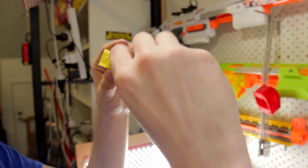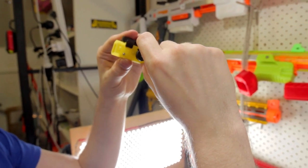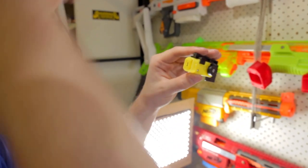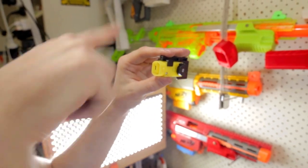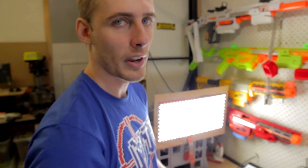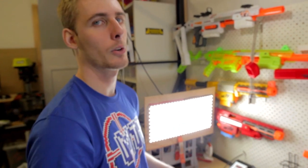So, when I turn this clockwise like this, the 90 degree gear, the teeth are going downwards. So in order for the teeth to go downwards, the motor needs to be spinning this way. And of course, this is looking at it from the back. So when we look at this way's revolution from the front, that is spinning clockwise, which means we need the positive, not to the red dot. Make sense? Because positive to the red dot makes it spin counterclockwise.